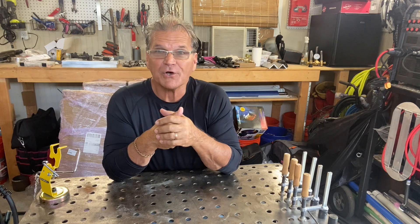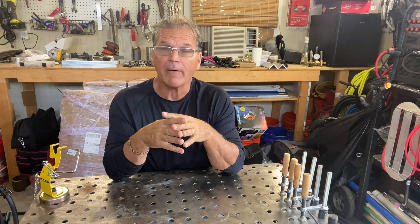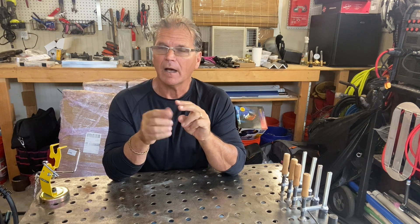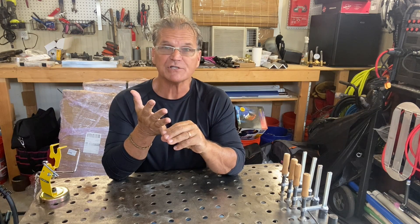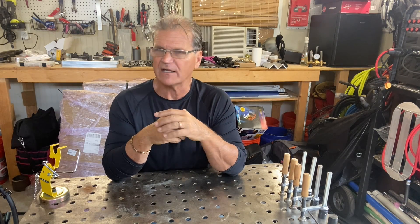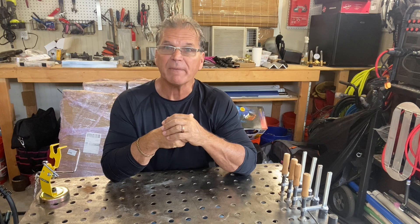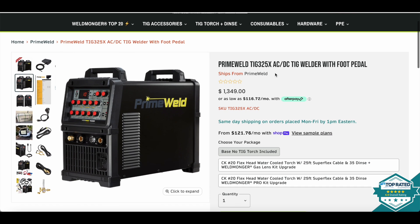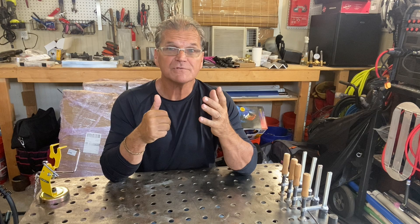Here are my first impressions on the machine. I will say this about the packaging: that machine is packed better than probably any machine I've ever received. Two things I'd probably change if I could: I personally like to have up slope and down slope on 2T and 4T, but on the 2T function this machine is just an on/off switch. The other thing is the fan is a little loud. I'm going to do more videos on how to get the most out of this machine - kind of a little mini series. The 325 is available by itself so you can order your torch and water cooler separately, or bundled with a water cooled TIG torch and kit. Stay tuned for more.